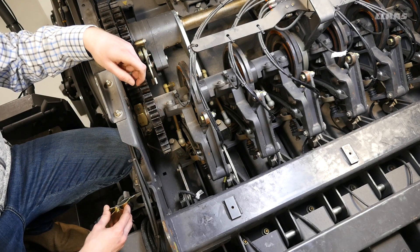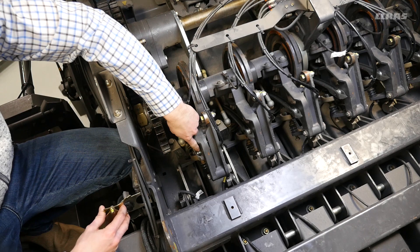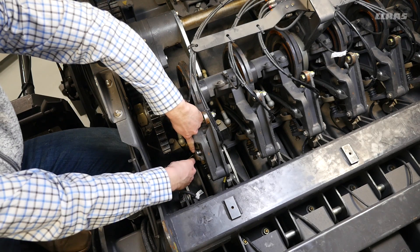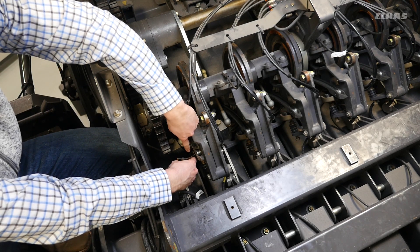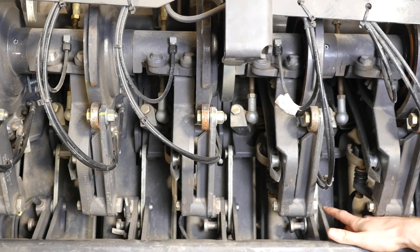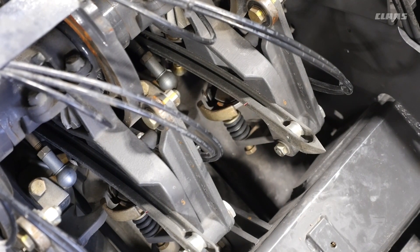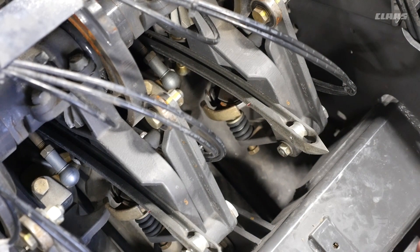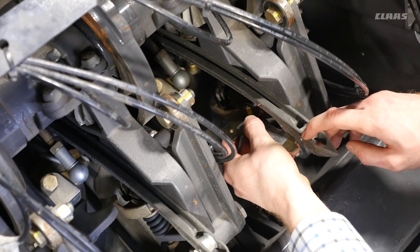Now we will begin to look at needle adjustments, starting with the height adjustment of the needle. To check this, we want to move the needle to where the wheel axis point is just above the retaining plate, then check the measurement to make sure it is 8mm above. Using the provided tool, we can verify we are at 8mm. A key service area is the twine load sensor, which needs to be kept clean of dirt and debris for proper knotter monitoring and automatic pressure control. To check needle penetration, we turn the flywheel until the needles are at top dead center. The recommended setting for needle penetration is 105mm from the wheel axis to the retaining plate, which can be verified with the provided tool.